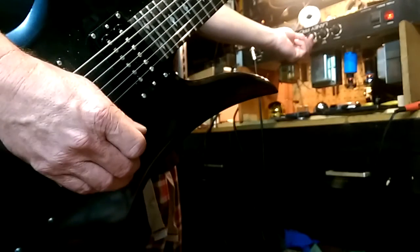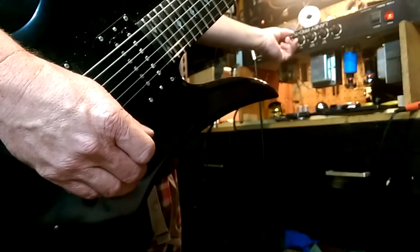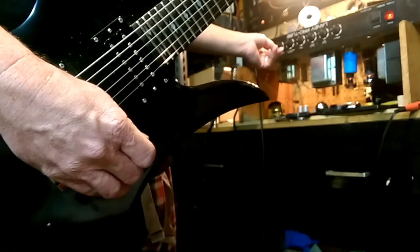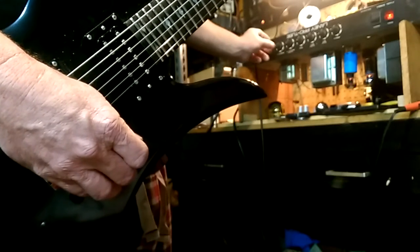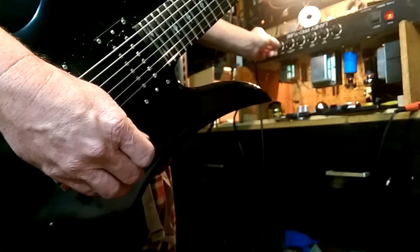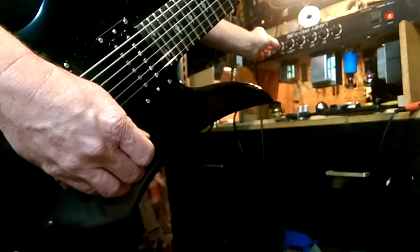It picks up my lead dress a little bit. But where it's nice, we roll these knobs back, roll up some more mids now, roll the treble back a bit, do the bass where it's at. And we can roll the preamp gain back a little bit and tighten it up since I didn't take the bright cap out. So you can hear that low end hum — that low end just rolls out. Now it's tight.